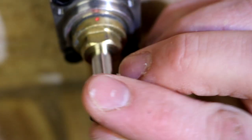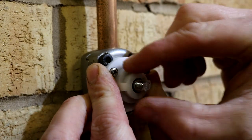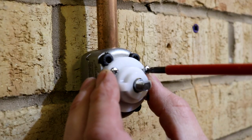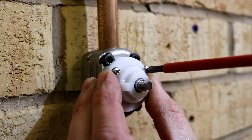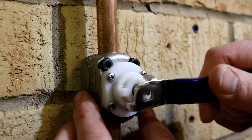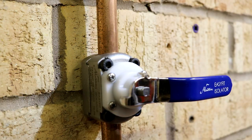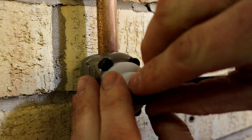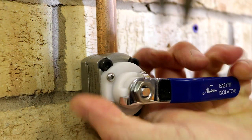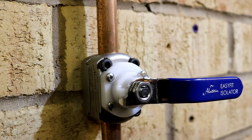Go ahead and remove the half nut. Then you simply push the collar — the white clip — back in place. At this stage I use a screwdriver, because these are very small screws and I do not wish to damage them with the drill. Once we've done that, go ahead and add on the handle so we can isolate. Then follow up with the back nut and tighten with the adjustable wrench. You don't need to go crazy with this — just nip it up. And that's it. Off goes the supply and we can crack on with the job it was meant to be doing.